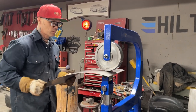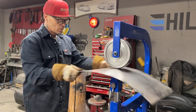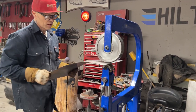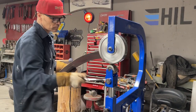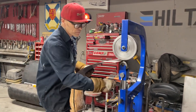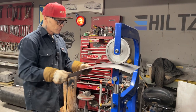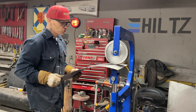That's basically where you gotta know where you're getting too much shape or not. I'm gonna take it to this end, trying to get that roll down with me, I guess. And this English wheel thing, you can watch me do it, but the only way to know how to do it is to do it yourself. Grab a piece of metal or grab a wheel and try it. But one thing for sure, the more contour of the wheel, the more action you're going to get.